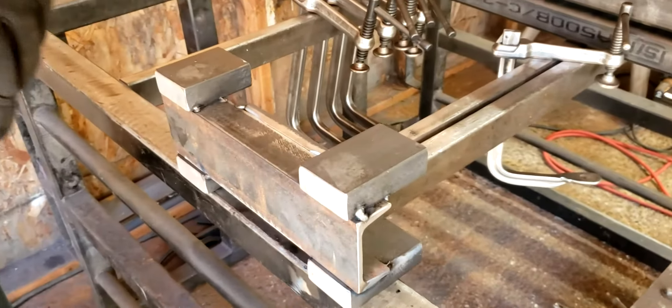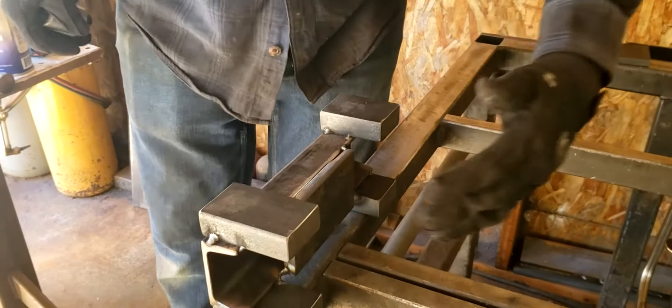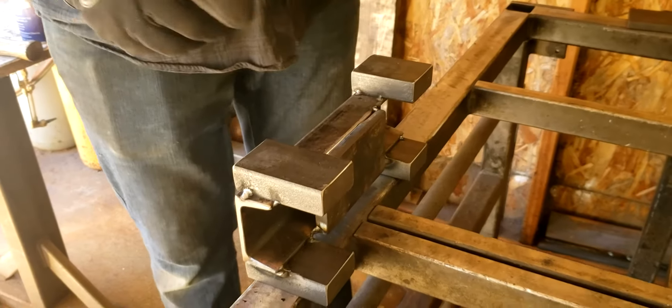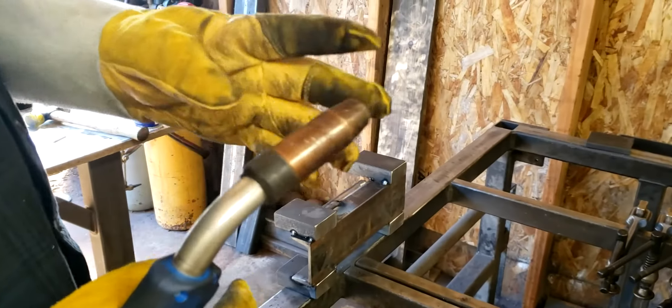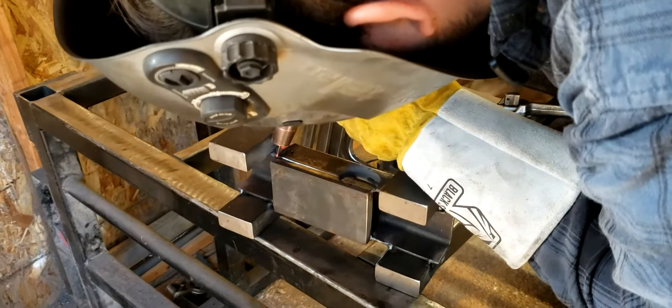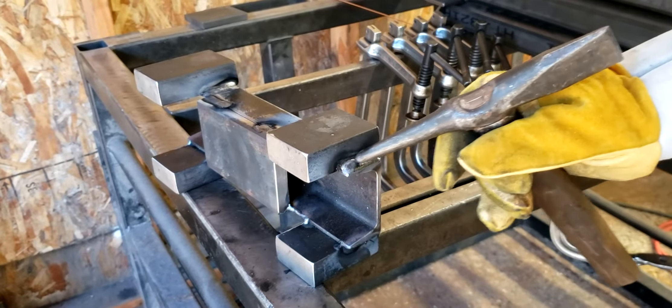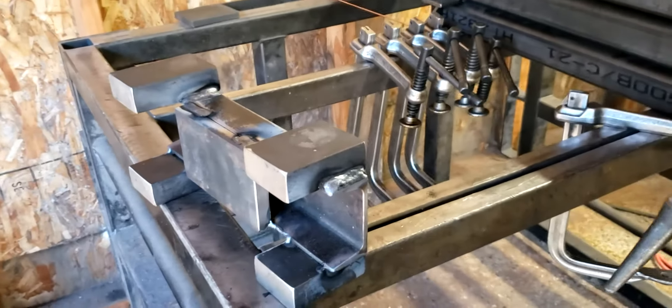My cam will go on this side and it's offset, so as you rotate it it will lift the other piece up and down. This is all packed together and I'm going to weld it with dual shield — it's a flux core wire that also has gas shielding, and it will sound a lot different than previous welding you've seen. With this process it leaves a flux shielding on top that you have to chip off. It's smooth and it's supposed to be — if you have dimes, you've done it wrong.